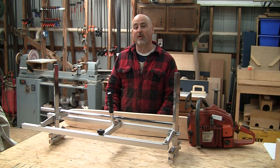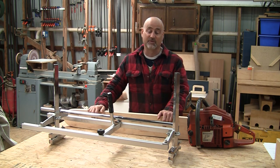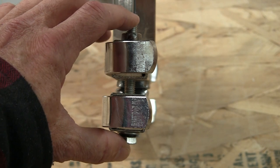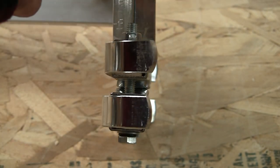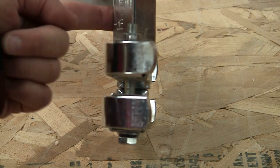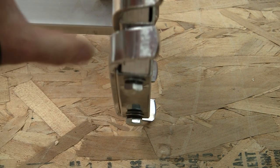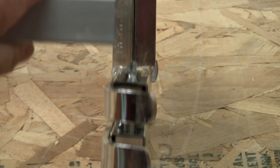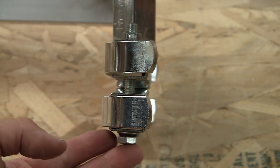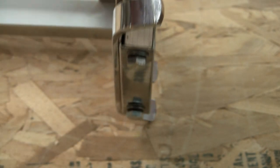The final tweak does require a welder, but I'm certain it will be well worth the small expense at your local welding shop to avoid the hassles caused by this really obvious design flaw. These bolts clamp the chainsaw bar to the mill. Originally, the nuts were welded to the bottom and you had to tighten the bolt on the top to clamp the bar — but this post interferes with your wrench. So I ground the nuts off of that side and had my buddy tack weld four new M8 nuts on the top. Now I can tighten or loosen from this side without any interference. That's important because clamping the saw in the mill is a hassle, especially with longer bars. Don't forget lock washers here as well.